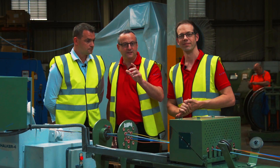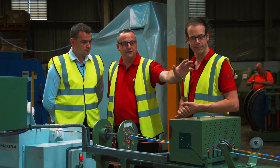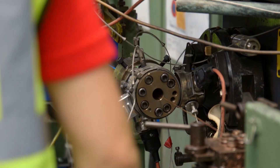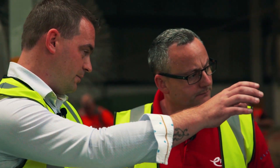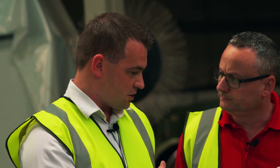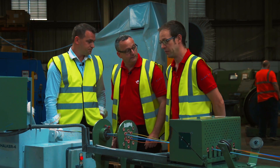At this next part of the process we're introducing the Cat5 data cable and the mains voltage cable together. Having finished manufacturing the cores and insulating the copper, the insulated cores and Cat5 cable come in through a high-voltage spark test unit, where they're continuously tested at high voltage to ensure electrical integrity. The cores are then twisted together to form a laid-up bundle, which will then pass through the next extrusion process — and we're just about to start the run now.